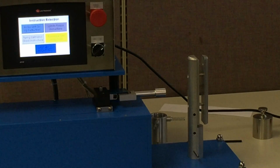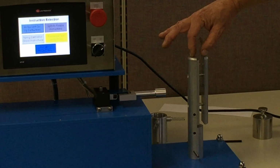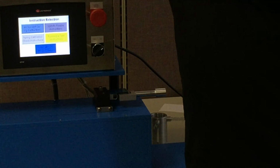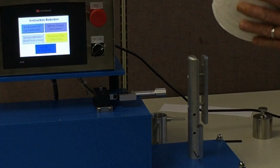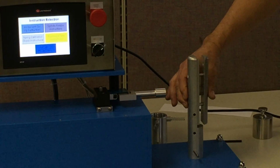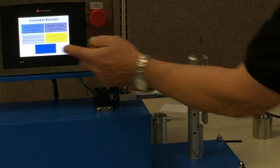On this new machine, we've improved the design where we merely add spacers to this existing spindle to make it accommodate these larger sizes. For example, here's a roll that has a core size of 2.25. Well, our spindle, as we have it set up here now, will go from 1.5 inches when it's totally compressed to only 2 inches when it is uncompressed.